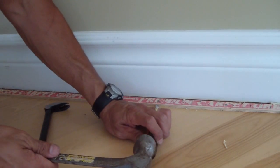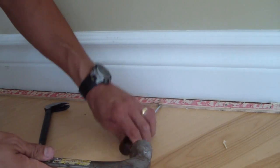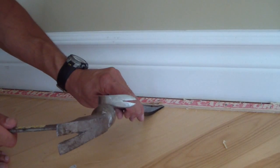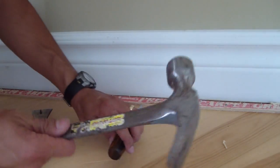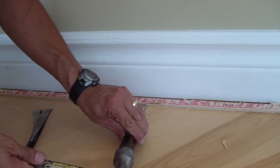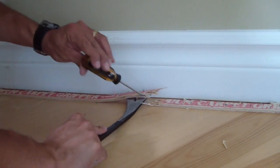Then what I was trying to do was sort of lift it in an axe-kind of move, but what happened is I was either gouging it with the screwdriver — obviously that's probably not the proper instrument — or trying to use this to get underneath. So what it's really come down to is a destructive process of the carpet gripper. You have to take into consideration the position of these half-inch nails, but the quickest way I've found is to delaminate — not touching the hardwood floor — into the material itself and then get underneath and just break it.